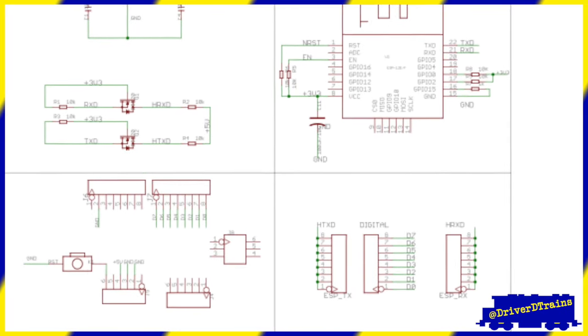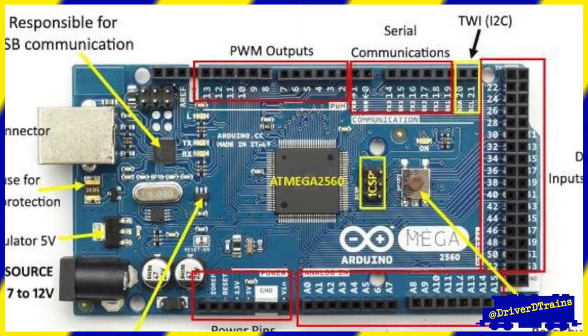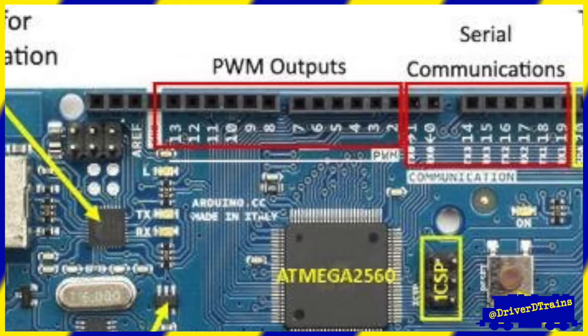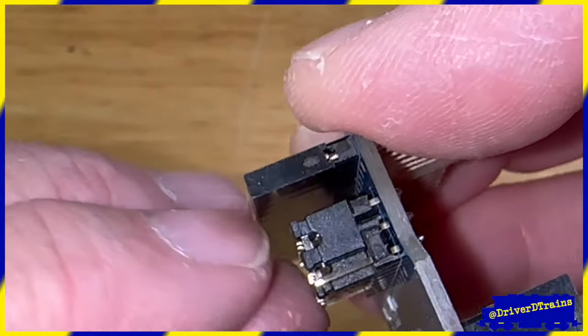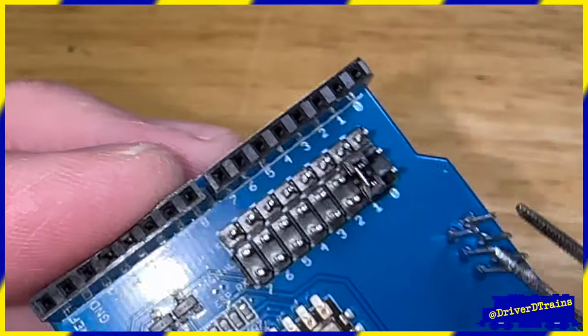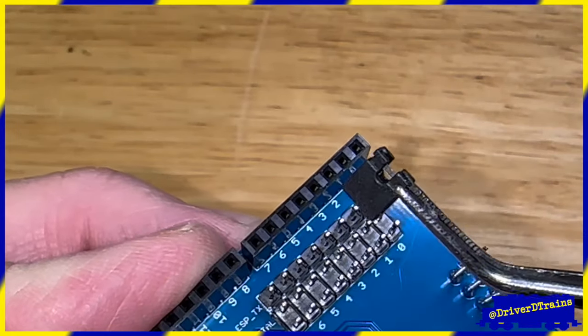The middle row of pins connects through the header sockets to some of the digital circuits in the Arduino that we will not be using for the Wi-Fi Shield. So you need to remove the two jumpers. You should be able to remove them easily with your fingers or a pair of tweezers. Just lift them straight up off the pins.